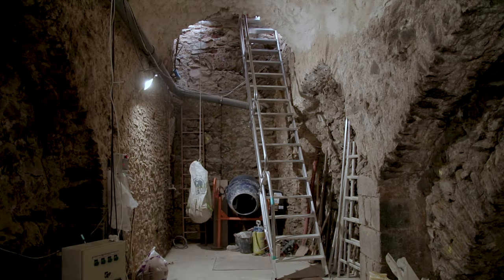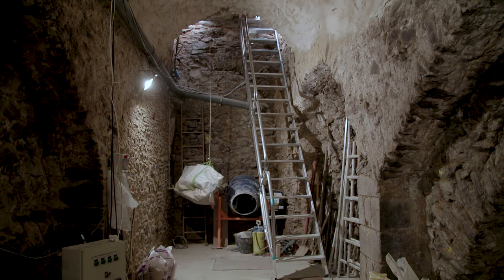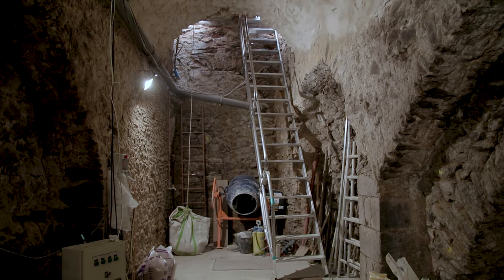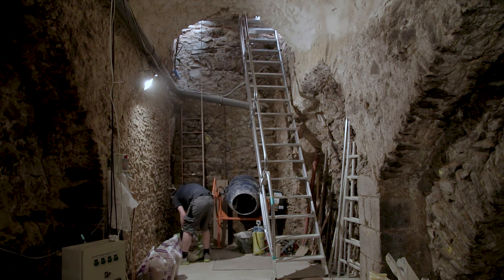As you can see and as you can imagine, Sundays are a bit of the worst. Just going to the hardware store, getting the sand in the car, trying to find a place to put the car near the house. And this particular day they were out of the finer sand I use, the yellow bags. The blue bags are 0.4 millimeters, the yellows are 0.2. So I'm using a mix of the two in my mortar. So I was a bit annoyed about that also.